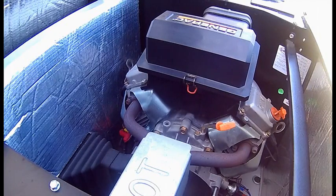I also have a heating element on the vent tube to vent water vapor coming up from the crankcase when it's running, which prevents it from blocking the vent tube and popping the oil out through the dipstick or blowing seals. And yeah, it's been pretty good to us.